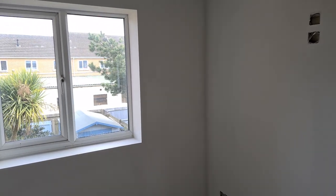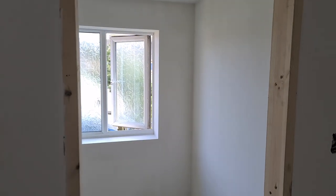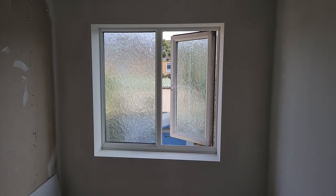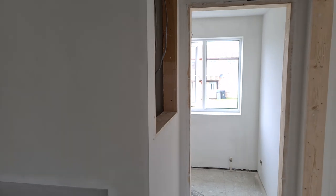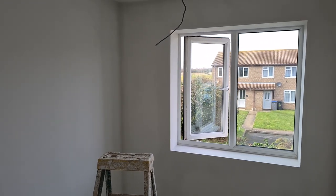So wet corners still. We started this job this week, and Monday I came in. I more or less taped all the upstairs, all the tapered edge joints. I did all the butt joints downstairs as well, and I taped all the corners upstairs. And Tuesday my dad came in and he put all the beads up, and I was hoping he'd finish the corner tapes downstairs, but he didn't. But normally that would be done. So 2 days taping really. Third day, I came with my uncle, who I was training. We didn't really get a lot more than one man's work done. Yesterday, me and my dad came, which was a full day. I sprayed this room.